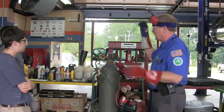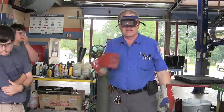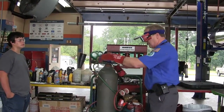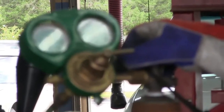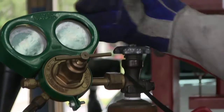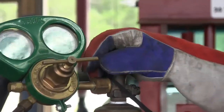I've already got safety glasses on, but I'm going to go ahead and put the goggles on like that. See, you can still see out of these; it's not like you can't see anything. Now zoom in enough to get these gauges when I turn this on. We're making sure it's not pointed at anybody. We're going to crack that open. You'll notice there's only about 600 pounds left in this bottle — we'll need to get another one before long. Most welders will open this all the way up.